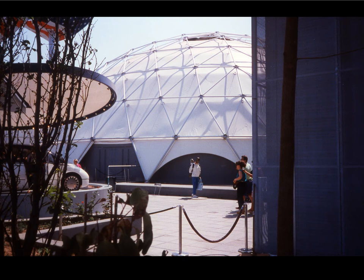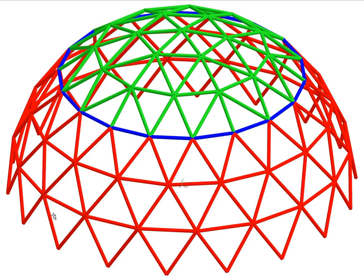And by the way, the small circle is very appealing, because as I mentioned, we can basically manufacture this entire dome to the same specifications. We can leave off this bottom part, and the remainder of the dome from this level up is perfectly sensible and balanced structurally. Likewise, we can leave off the first two bands of structural members, and the remainder of the dome makes sense structurally. So we can have a whole series of domes out of one kit of parts.